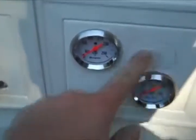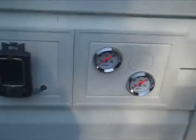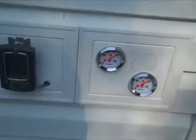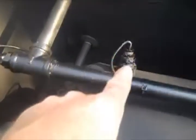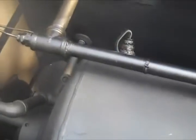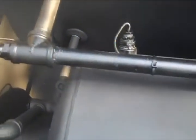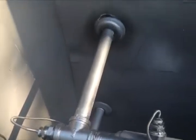I've got the thermometer in place and the gauges in place. I don't have them labeled yet. This one's going to be going to the water outlet, and this one's going to monitor the actual temperature of the water inside the tank. That probe monitors the temperature of the water inside the tank. What I want to know this time is if the temperature coming out of that tank through the pipe is actually any hotter than what's in the tank. That's why I put that second temperature probe there — hopefully sometime today or tomorrow we shall see.